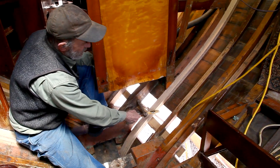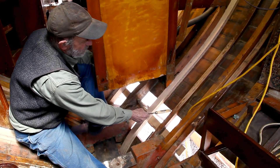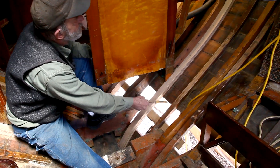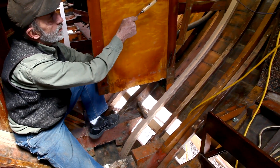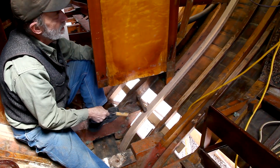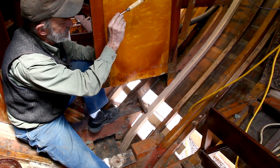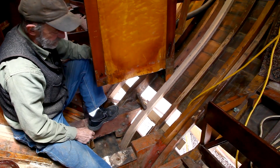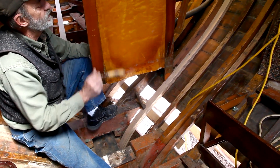These were minor frames. This frame was identical to this one when it was in the boat, with the bulkhead alongside it. It also had a chain plate — originally a steel chain plate laid on top of that frame and bolted down through. There was deterioration at the top end and also some deterioration down below where it was broken. So we set out to replace it.